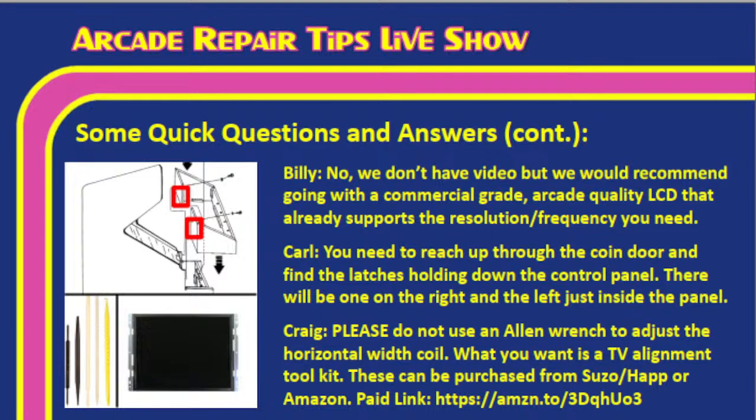Exactly. Carl, you can reach up through the coin door and find the latches holding down the control panel. There will be one on the right and one on the left just inside the panel. But then, like Tim mentioned, you're going to have to take out the bolts as well. And Tim, I highlighted the latches in red over here on the left-hand side. And then you can see the bolts going into the back and the bolts going down slightly in that diagram. So those are going to be the ones you'll need to take out. Plus, you'll have to undo the connectors, like Tim mentioned. So if you're going to do that, I highly recommend you put labels or tape or something on those connectors to let you know which one goes where.